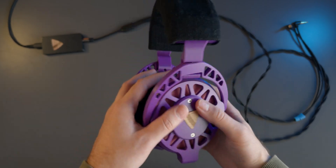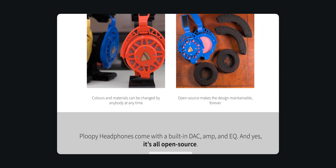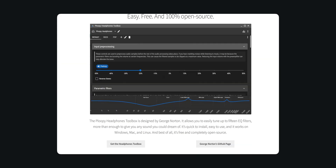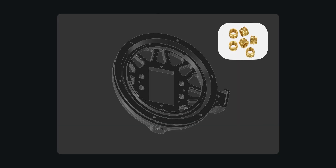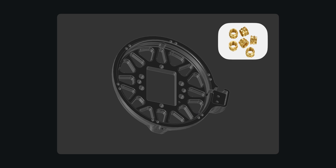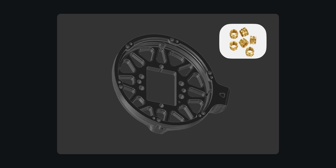Given that the project is open source and the headphones are almost entirely made out of replaceable parts there are opportunities for customization and modding. So here's what I did: first things first I modified the existing designs and added holes for heat set threaded inserts everywhere to be used with M2 and M3 screws.